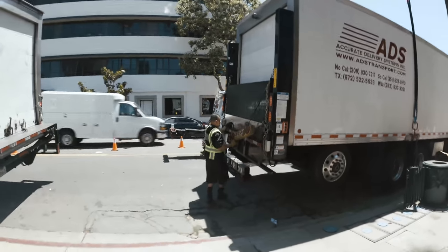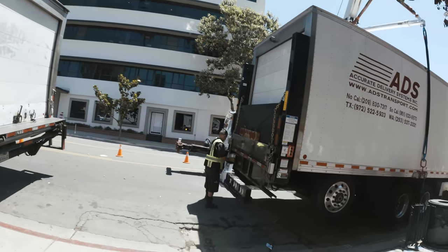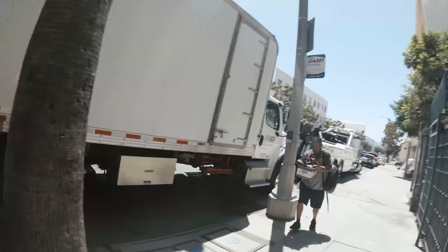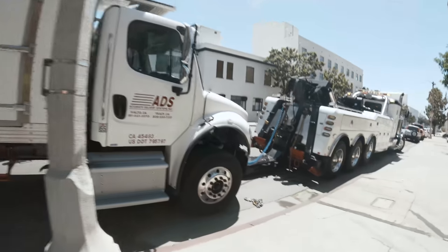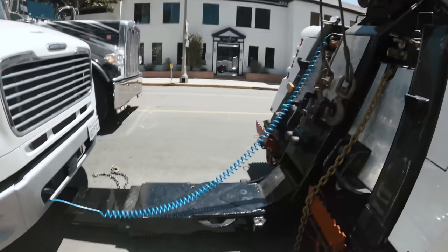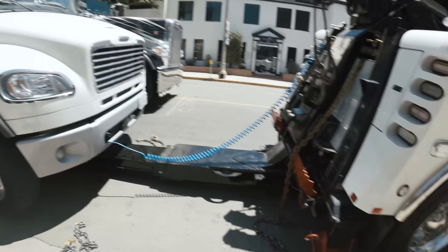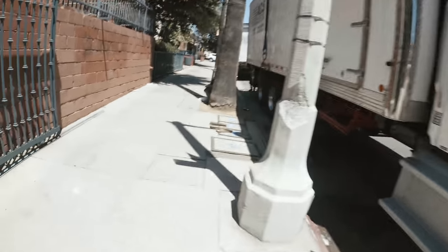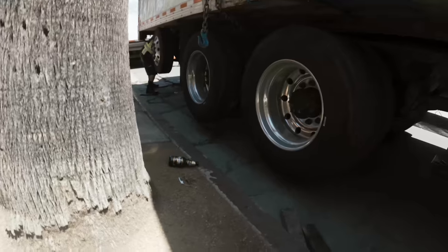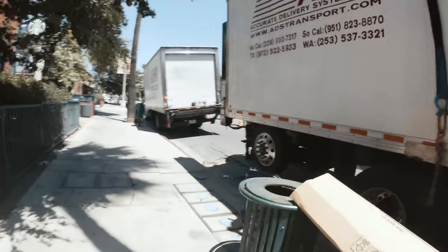Joe putting on the light bar. It's fully empty now. Lightweight. Already on the underlift. He uses quick connect fitting to air up the whole system from his truck. That blue line right there. Next is just the Omega links and the safety chains. And we'll use this wood to do a little bit of cribbing while I got it suspended. As you can see right there, I got this side completely in the air. Those tires aren't on the floor. Then once we crib it, I let out and see what it does.